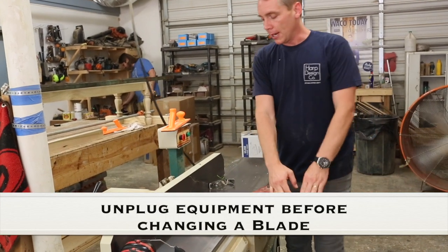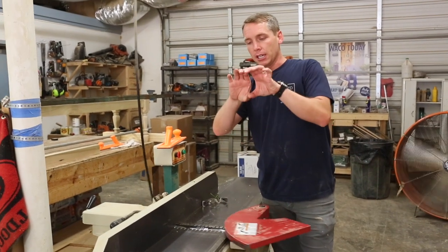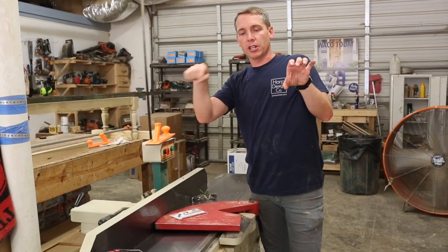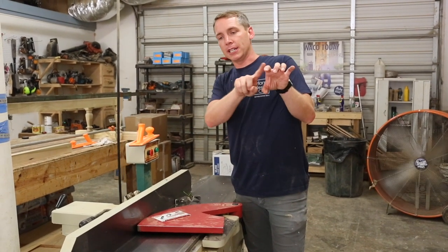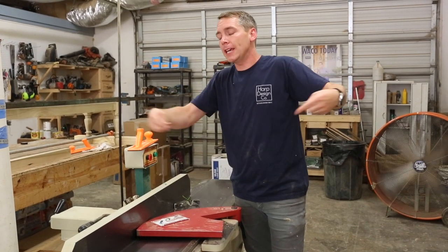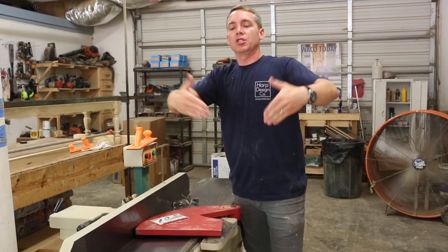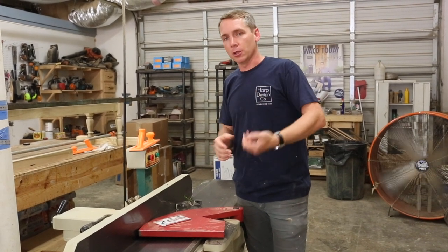So a lot of times with a joiner or a planer, the blade is on a cylinder, if you will, and then on that cylinder you have a straight blade, three straight blades, rotating in three, and then that thing rotates at a really, really high speed, and those blades just kind of rake over the wood, if you will, and just take all the wood away.